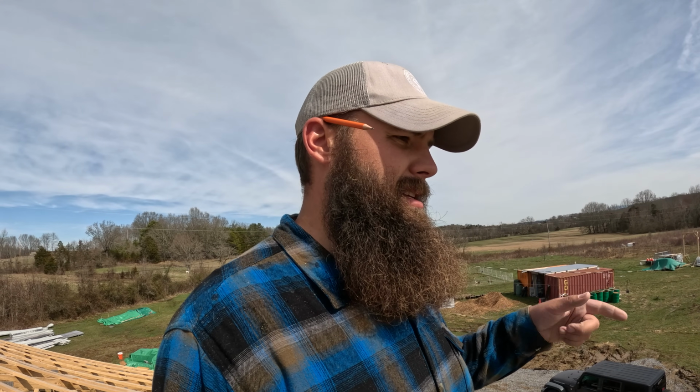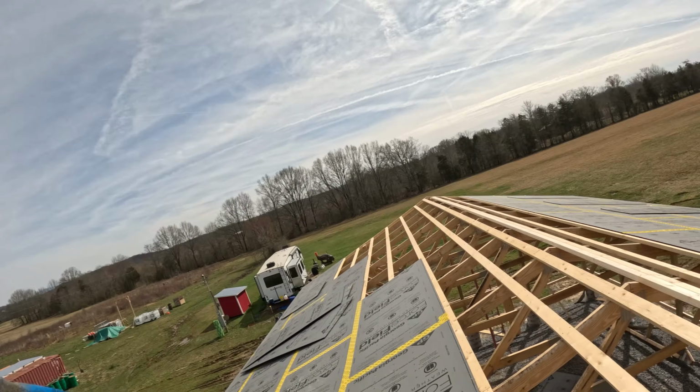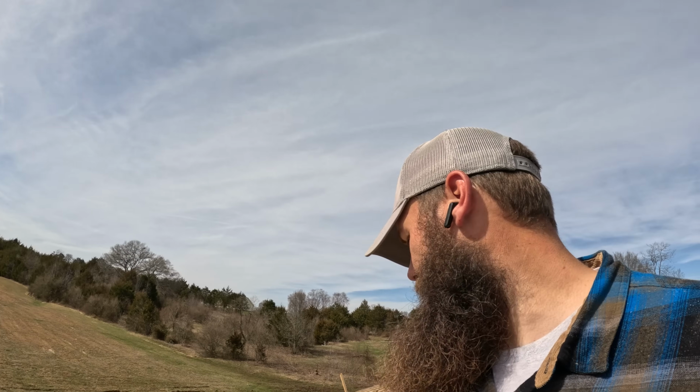So this morning I did some cleanup down there. I cut the boards that I need for the ridge on both sides. Got those cut. And first thing this morning, I also added, you can see here, this second ridge beam. So the post on the other side, I didn't cut it down prior to adding the purlins. So I had to space that last one down a little bit, not thinking that I needed to nail off the sheathing. So I had to add another purlin on the top,